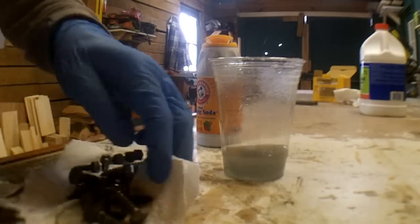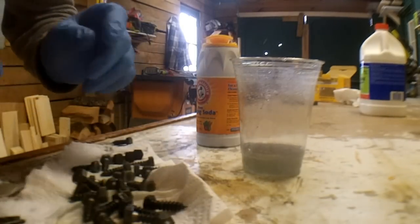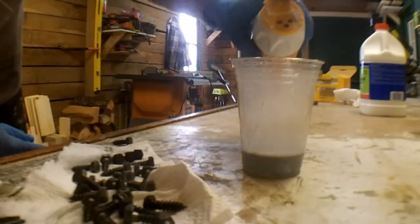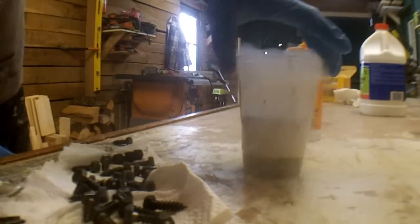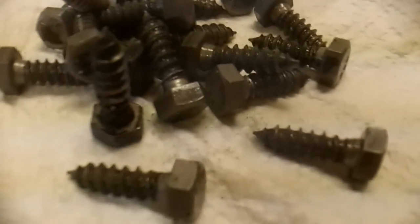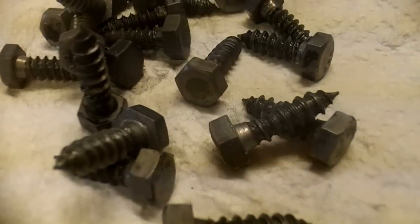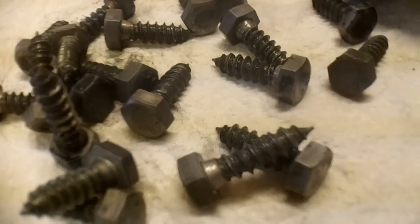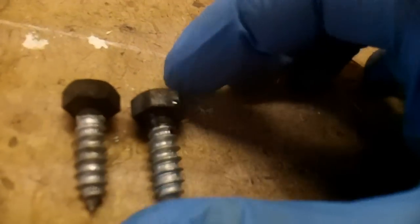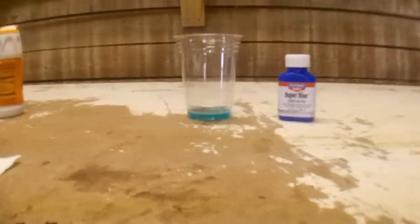These things are almost too hot to touch, which is kind of crazy. I'm going to try to neutralize this and throw it away. These are the ones straight from the acid. I can see some where all the zinc came off, and some where the zinc did not come off. I'm going to do all of these and see which ones turn out which way. The ones I didn't strip — just dipped in the blue — I'll leave off to the side as my control.